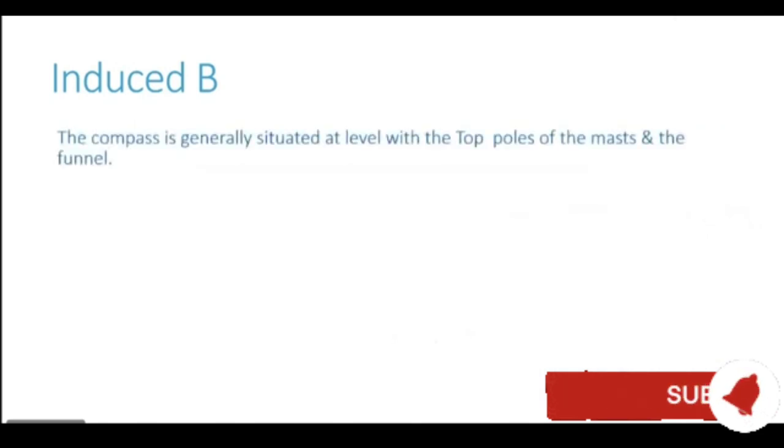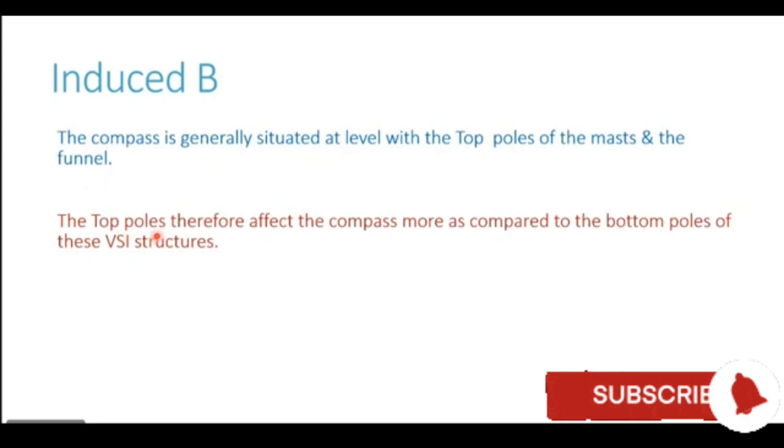As we discussed just now, the compass is generally situated at level with the top poles of the masts and the funnel. The top poles therefore affect the compass more as compared to the bottom poles of these vertical soft iron structures. We are aware that the compass is affected by that pole of the magnet which is closer to it. So the compass is situated in line with the top poles of these vertical soft iron structures. The top poles affect the compass more, and the bottom poles, being far away, do not affect our compass.